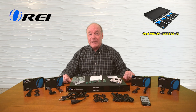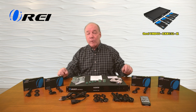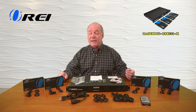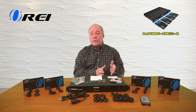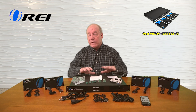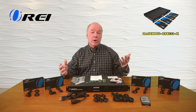I hope you found this overview of the UHD66-EXB132-K 6x6 HDMI matrix and extender kit helpful. It provides an incredibly easy way for you to share six different HDMI media streams with four remote locations up to 130 feet away in full 4K ultra high definition resolution, or up to 230 feet away in full 1080p resolution over a single Cat5e, Cat6, or Cat7 LAN cable. The inclusion of the infrared blaster kits means each remote location has total control over the content they're watching. The local loopback functionality allows you to extend two additional monitors up to 10 meters away. Power over cable technology greatly simplifies your wiring, and the matrix allows you to completely control both the audio and video sent to each location using the remote control, the buttons on the front, or through software control.